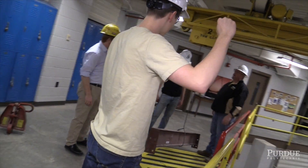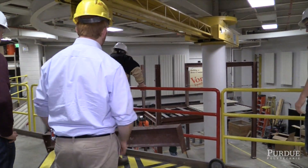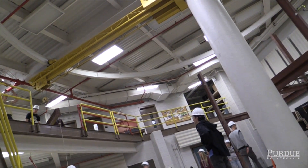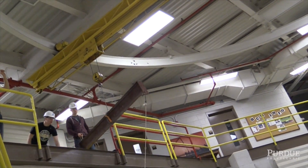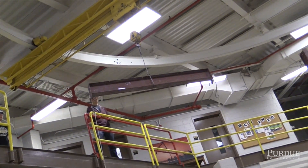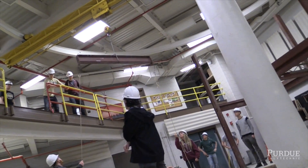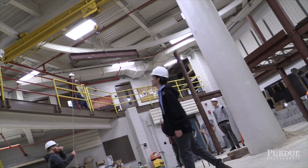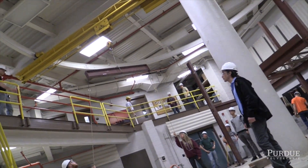Not bad, right? We can live with that. So where's my tag lines? You might see the rope with the hook — tag lines. Okay, now let's bring it down. What I want is to drop it down to where we can put our hands on it, right? Instead of flying it through the air, it's going to make a lot of bangs. If it's closer to the ground, we're more able to control it.